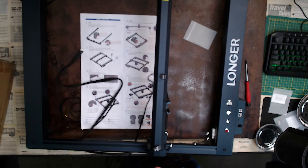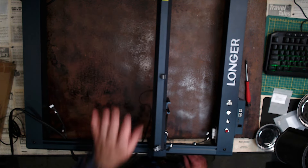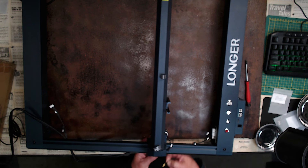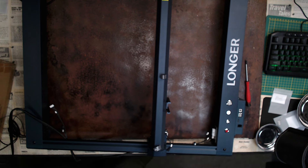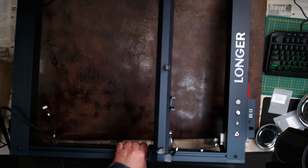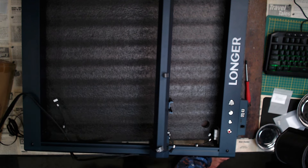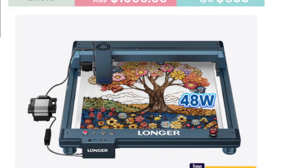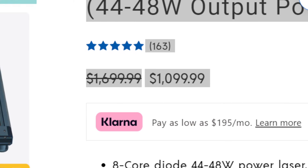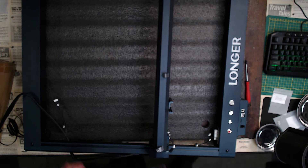It'd be a good idea to put this piece of foam on here so I can turn it upside down without damaging my laser. Currently on the website it is listed — the RAISE 5 — at $1,099 at the moment, with $600 off. So I'll turn it upside down using the bit of foam it comes with. Don't lift it by the rails and try not to allow it to roll backwards and forwards. Tip it over gently.